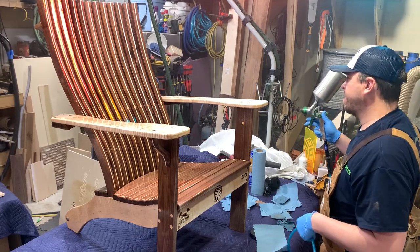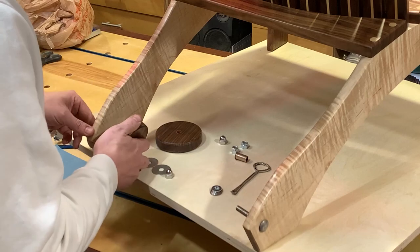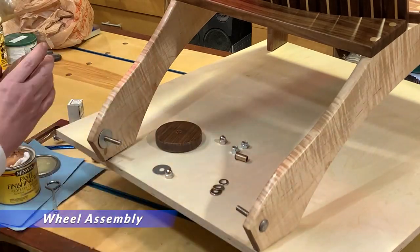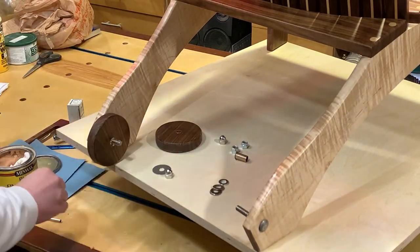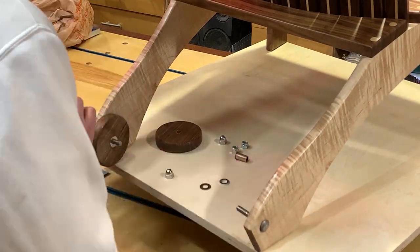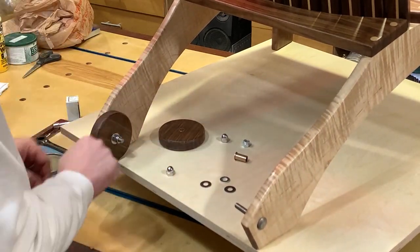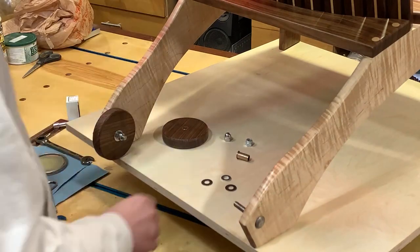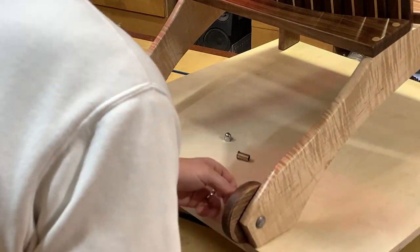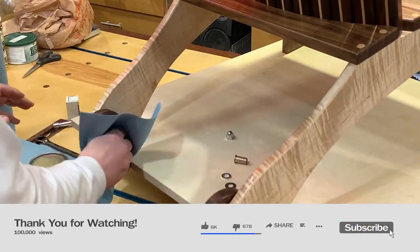In reality these chairs might get moved once or twice a year, so instead of buying an off-the-shelf wheel, I thought it'd look nicer making one out of wood. All I did was use a three-eighths-inch bolt, a fender washer, and a bearing flange I found at the big box store — that acts almost like a bearing for the wheels and gives it nice smooth action. A little bit of wax in there and these wheels roll great. With that, the project is complete. Thank y'all so much for watching — please like and subscribe and I'll see you on the next video.